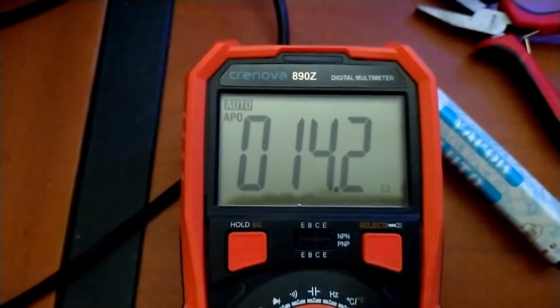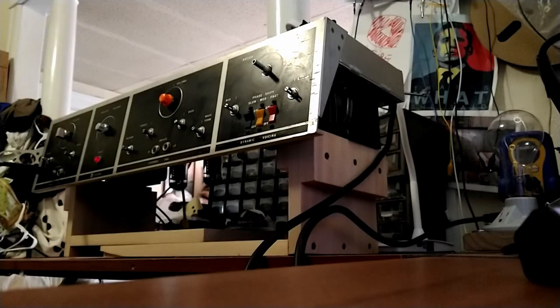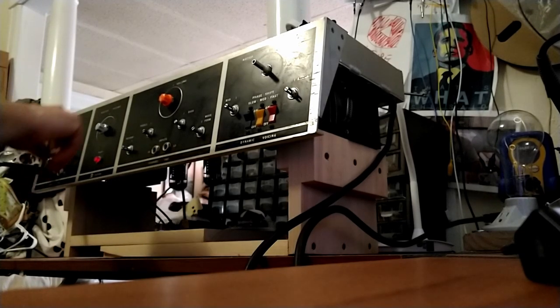This will be good enough for now, for our purposes, just to give the amplifier a load as we fire it up. Dialing her up, I have her at a little over 80 volts from the wall in the variac. Tubes seem to be... Pilot lights seem to be on. Let's see what we got.